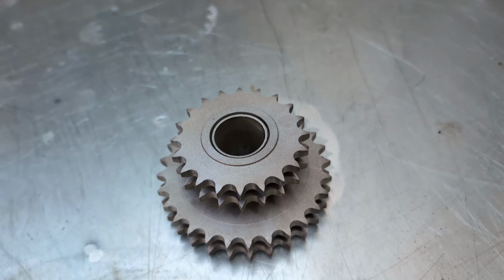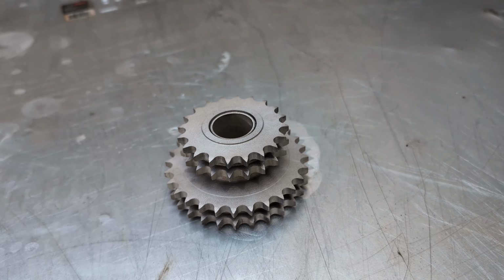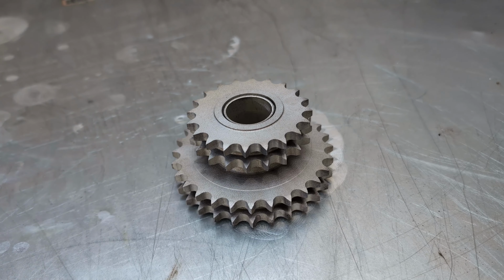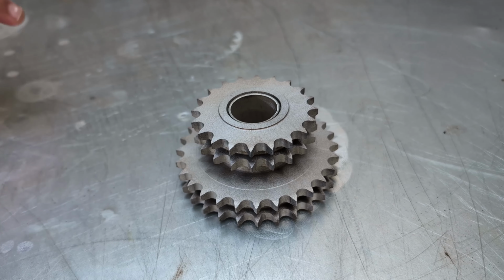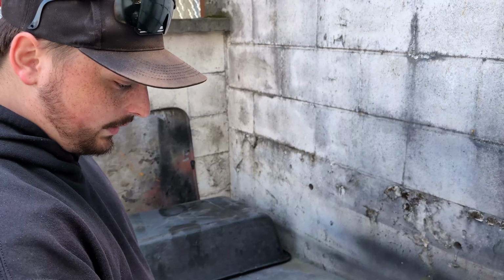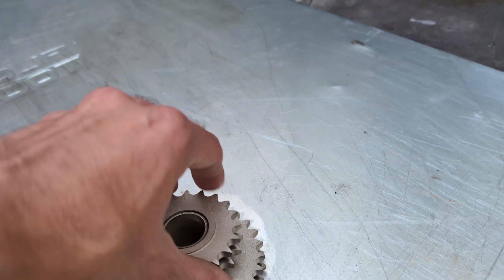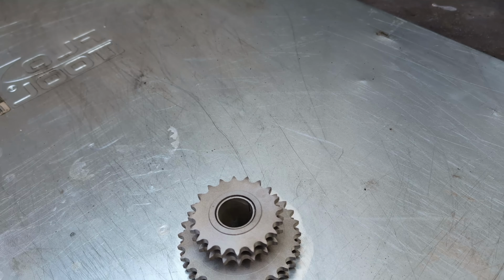Well, this is something new. I'm really into this. So do you have to change the settings at all for the steel? Yeah, yes. So a little bit. It depends with the molecular makeup of the material. So for instance, with steel, it's a little more dense. And so with that, we do need to change the frequency and the nanoseconds of the pulse width. Okay. Yeah, wow. I'm impressed, though. That's so nice. There'd be no other way to do this other than just getting the scrub brush out, right? Exactly.